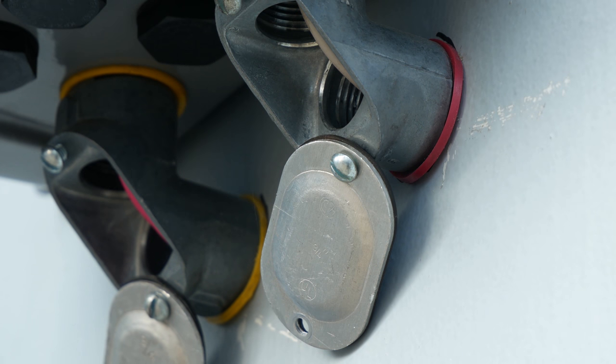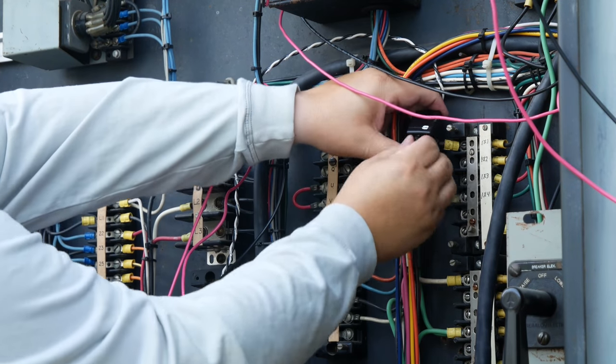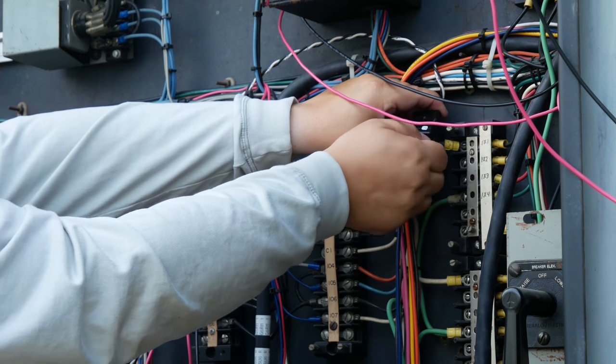You will need to run some sort of conduit to get the conductors from the control cabinet to the B100. In this example we used conduit pulls. Right now we are installing the CT in the control cabinet.